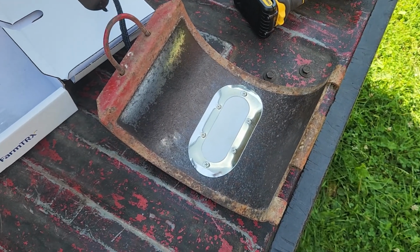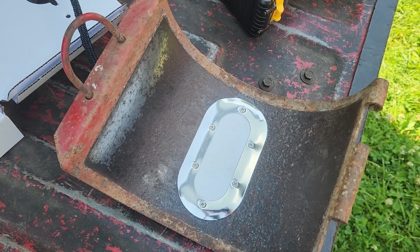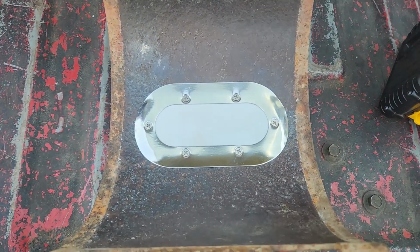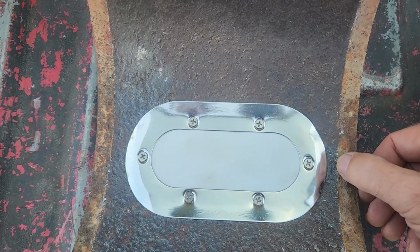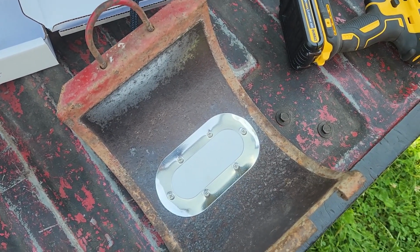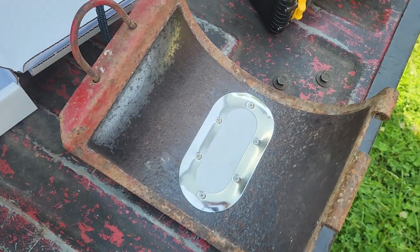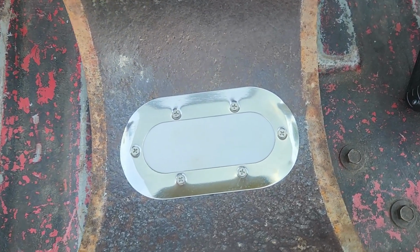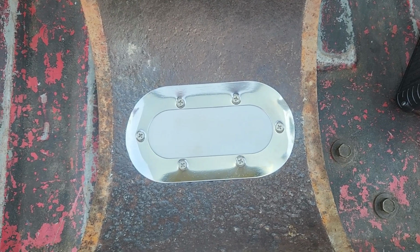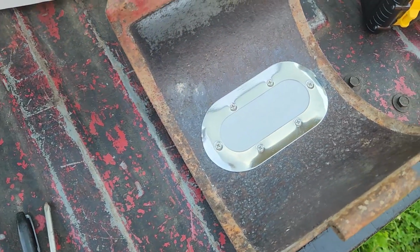All right, folks, just an update on the 1460 FarmTRX installation. This is the moisture sensor. Goes in the bottom of the clean grain elevator. They have you put it in the door. This is on a 1460, which doesn't have too wide a door, as you can see where the witness marks are for the opening. The instructions will say to favor being on the auger side. I think that's just to make sure that's adequately covered with grain the entire time. But this door is so narrow, I think, compared to newer models, perhaps, that I basically ended up almost centering it. It's favoring the inside direction of the machine just a little bit, but not bad.